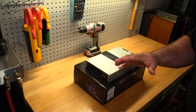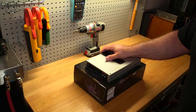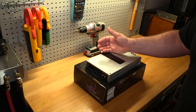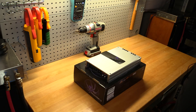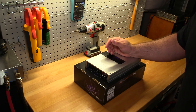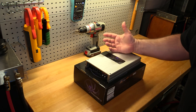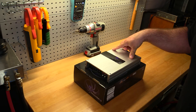I can't explain it. Some of these tests you saw one channel really explode up — it was putting out 320 watts and all of a sudden the other side was putting out 190. Usually that means the gain is set wrong or something like that. But I recalibrated this amp three different times and the gain was fine. I even switched around the inputs off camera just to see what it does — still getting the same funky ratings. It's just a badly designed amplifier. I'm sorry if you bought one; if you can, return it. Definitely do not buy one of these.